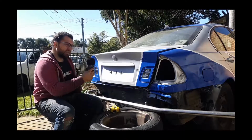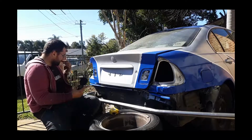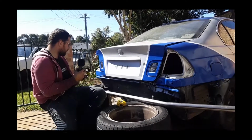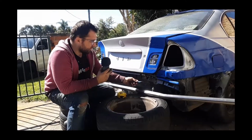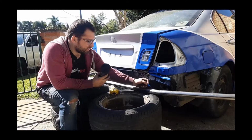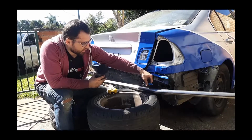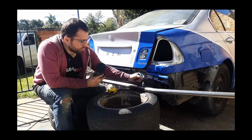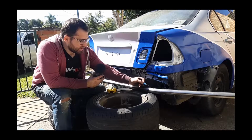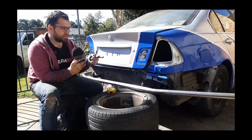Now, in this case, because we're trying to make a symmetrical piece, what I noticed was the bend that we tried to make was from this point that way, right? And on this one, we should have put the tube in the opposite way, because here's the mark of where we started the bend, but we needed the bend to go this way so that the bend ended up here. But instead we put the mark in there and we put the tube in the same way that we did the whole thing, and we made the bend go that way.